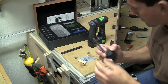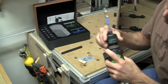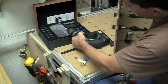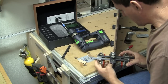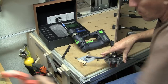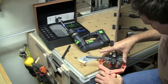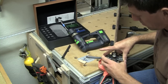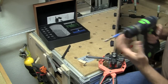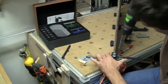Alright, so we've got that ready. Pop this onto the C12 drill, get it dead vertical, and then put the drilling jig on for the first hole. After we take it off we'll be able to set the second hole. I like to use a clamp on here to make sure it won't wiggle free. It does have screws you can tighten up to keep the clamp from letting go, but a clamp gives it a little extra support. Let me set this so you can see the drilling — I'll slide it over to the other edge. Let's go.